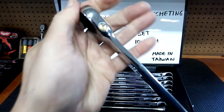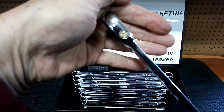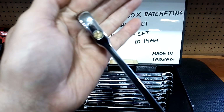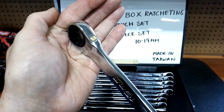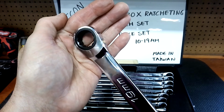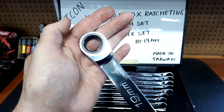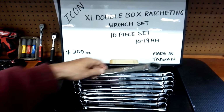And like I said, you could take that shellac off of there and tap it with a little screwdriver. If I can get the focus, see, I think this one I already did it with. Tap it with a little screwdriver. The shellac will come off, undo it. You can either put lube in it or back it off a tiny bit if you think it's got too much drag on it. Absolutely love these.